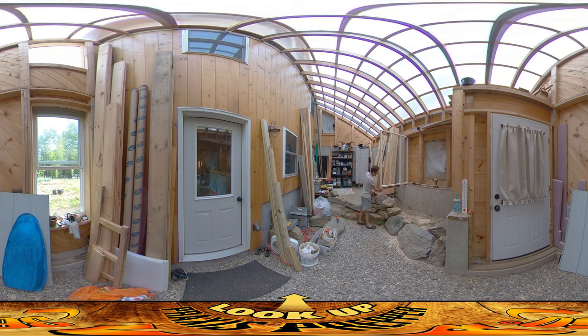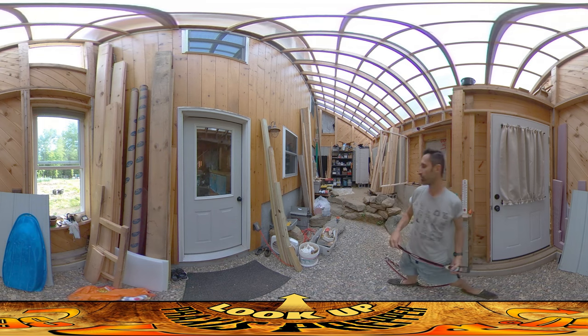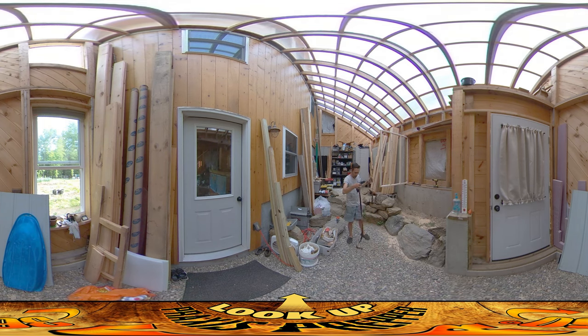Once I get this wall off pretty exactly the way I want it — at the moment it's hanging a little bit — I'm going to use a ratchet strap. This is just the kind of tie-down strap you use for your vehicle. I've got a screw here and a screw over there, and I'm just going to click it until we are level. There it is, right like that. So I'm going to build the whole thing and get it rigidified.